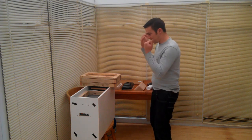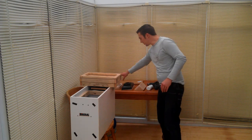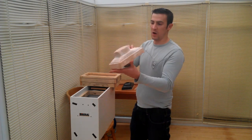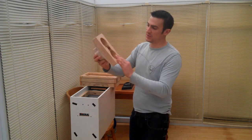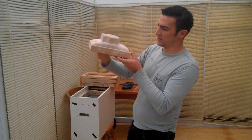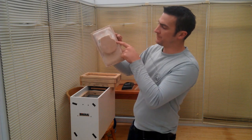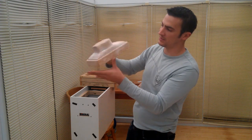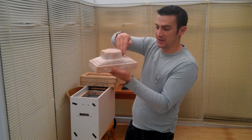This is my improvised vacuum forming machine, and a couple of little moulds I've been playing with. This one is for a casing — it's hollow on the inside, and I've created small breather holes that go right through to the inside to allow the plastic to be drawn into all of the corners of the shape.